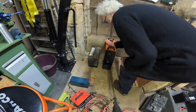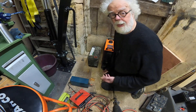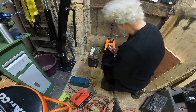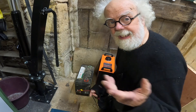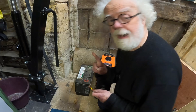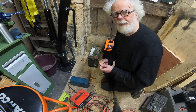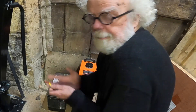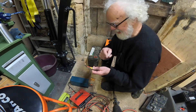If I only had a VIVOR diesel heater, I could heat my workshop using that oil — that's the plan. So they sent me this beast. It doesn't plug into the home power supply; it's for a pickup truck or an RV, and comes with a power lead for a 12-volt battery. When I looked at the VIVOR instructions, it said the preheat, the glow plugs, and the pump — only when it first initializes — needs 12 volts at 15 amps. I don't really have a 12-volt 15-amp power supply, but I've got a whole lot of old 12-volt batteries from cars and lawn tractors. So let's give it a try.